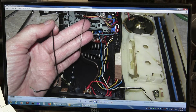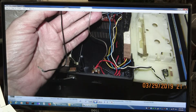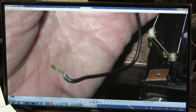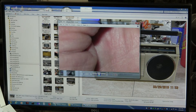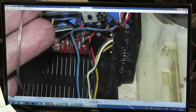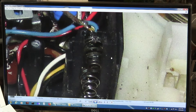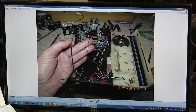This had a power issue — the battery compartment had a bad wire. One end here was corroded — all the wire was corroded all the way down to the other end. So no power was getting through. There was a corroded dark-colored spring, but I cleaned it up and put a new wire on there and got it to work on batteries.